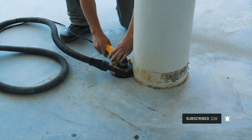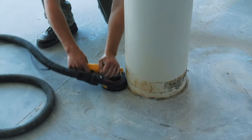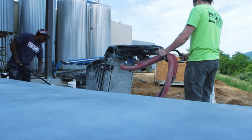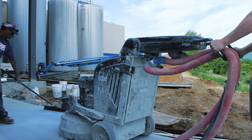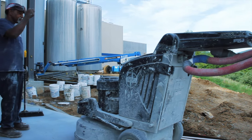Typically what we start with, if we can get away with it, is a 30 and 40 grit diamond. We live in a really hard area of concrete. So we were dealing with new concrete and old concrete butted up against each other. We started off with a 30/40 grit medium bond diamond — medium bond meaning it's in between hard and soft.